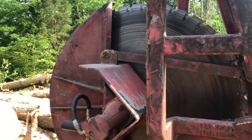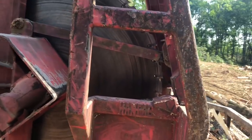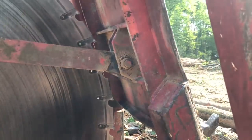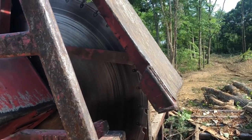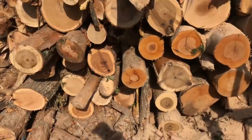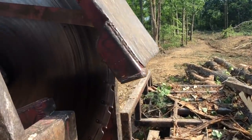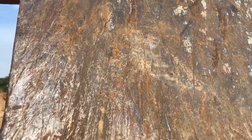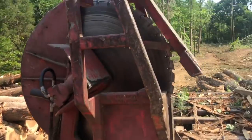She thinks the saw's getting rattly. I bet. And y'all watching them little pins there, they're in that surface area and they get loose and wobble there. That's all it is. That's just how it is. It'll probably wear down till this bar's wearing right on the guard itself. And you just grease the shit out of it and live with it. I don't like it. Well, get over it.